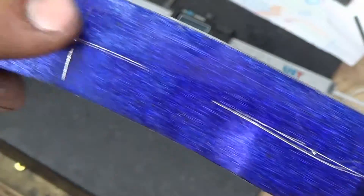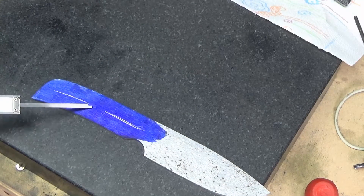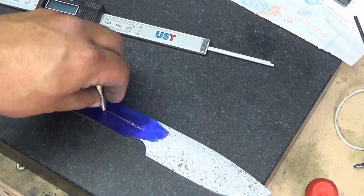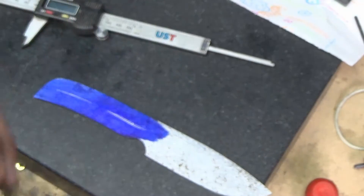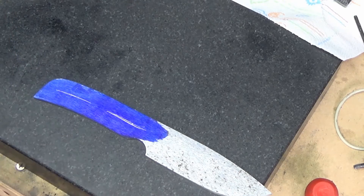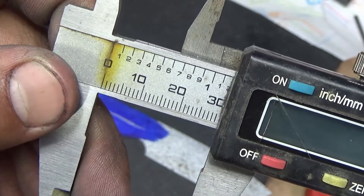This is going to be very handle heavy if I don't maybe drill some holes in the middle. So I'm going to make a hole dead center and I'm going to use one of these big old step bits. It'll give the epoxy somewhere to go and it'll lighten it up just a touch. I got this at Harbor Freight for five bucks — they don't last forever, but for five bucks they work pretty good. So we had 60 from hole to hole, so let's go half of that — knock it down to 30.